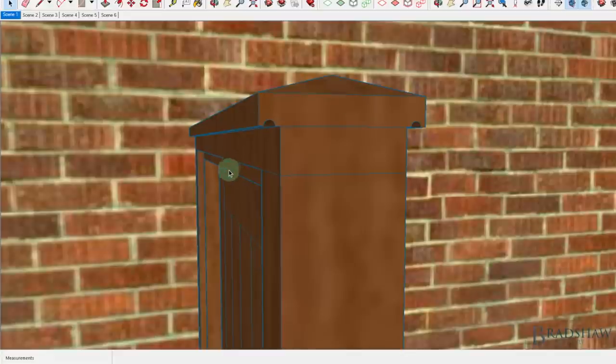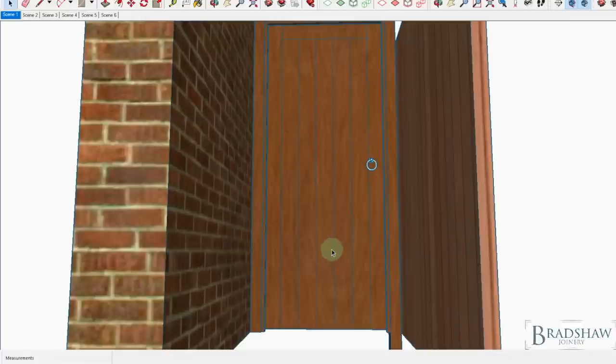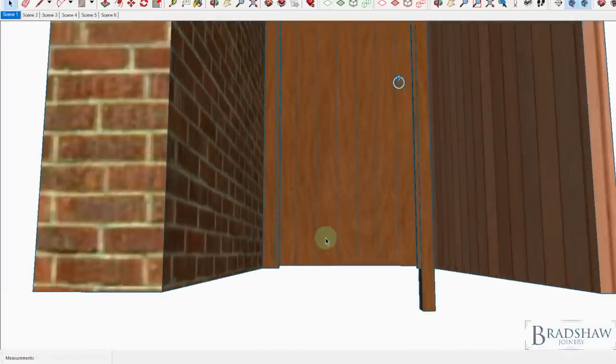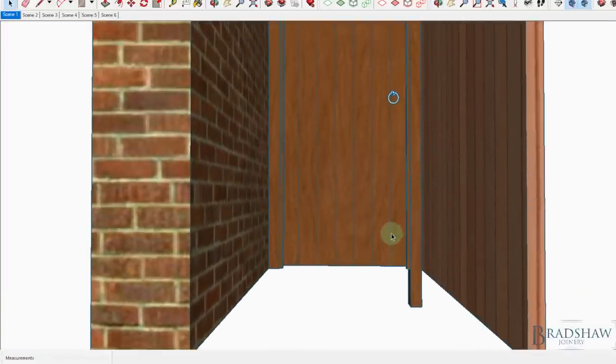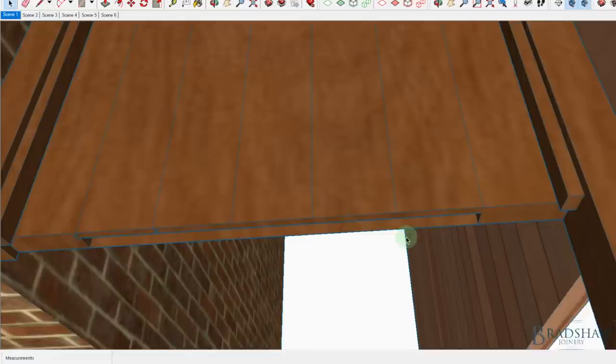The door itself is divided up so all the panels are equal, so the boarding is exactly the same size as the stiles. I like to do this because it just looks nicer. It's much nicer than seeing a wide door style, then a narrow board, then other sized boards in the middle, then another narrow board, and a wide style again. It just doesn't look bespoke made. The more even you can get them panels, the better, in my opinion. So I like to divide them across the width of the door and make them all equal.